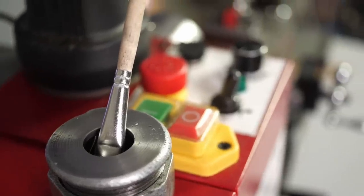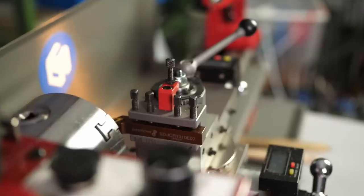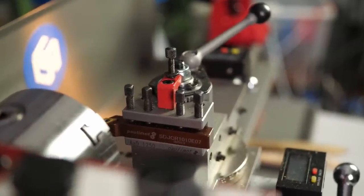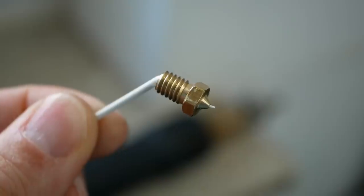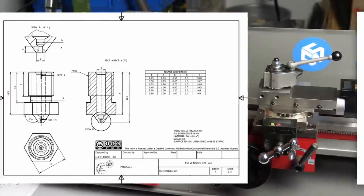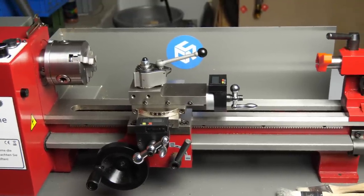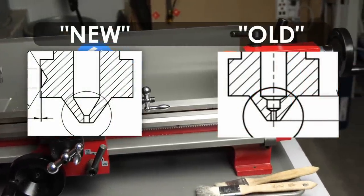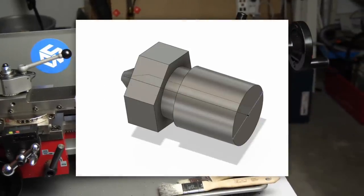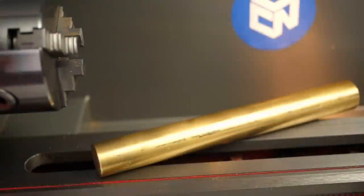I've had it for a good two weeks and seriously enjoy using it. I'm not a trained machinist and the last time I was working on a lathe was 13 years ago. To learn using one of these machines again, I thought it might be interesting to try to machine a 3D printer nozzle because it has a lot of features that are a bit challenging and a good way to learn, most notably the 0.4mm hole in the front. I'll be using the E3D V6 nozzle design but chose an older version of the drawing that doesn't have the 60-degree taper on the inside because I don't have a tool for it. The old design uses a step bore which is not perfect for the flow but will probably still give us 95% of the performance. I did a quick design from the original in Fusion 360 to create another drawing with all the dimensions important for machining, especially the depth of the bores measured to the tip of the drill bit.